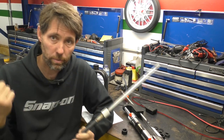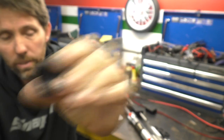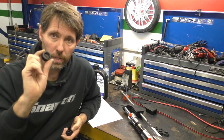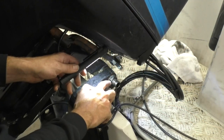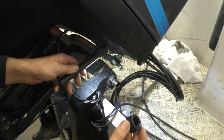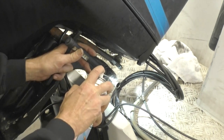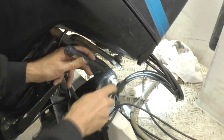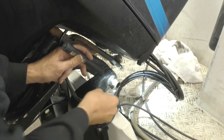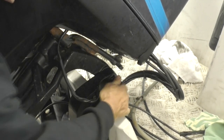This collar that used to go onto the threaded end of the tube — locking the steering cable on — is replaced by one of these. It's got a grub screw on one end to lock it and it threads on. The kit comes with two because sometimes there's thread on both ends of the tube; in this case there's only thread on the starboard side. These tilt tubes are steel so they can corrode — you can end up with paint, rust, or grease on here. This threaded spacer needs to wind on without tools according to the instructions, so I'm going to clean this thread up and lubricate a little bit before putting that spacer on.